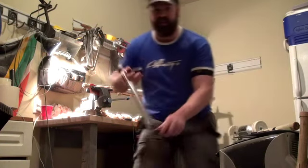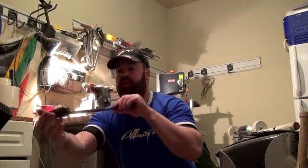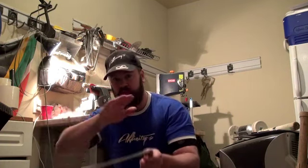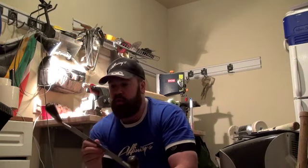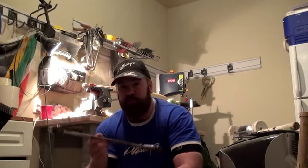In amongst. That's the other type of draw knife. A bit more traditional. You'll be able to see from the angle, it's already kind of preset, so when you pull, you'll take a certain amount off. They are very, very good for pulling off bulk. Realistically, I think a more skilled bat maker than myself would be able to handle this and be a little bit more intricate. As I say, it's a preference thing, which is why I choose to use the French.